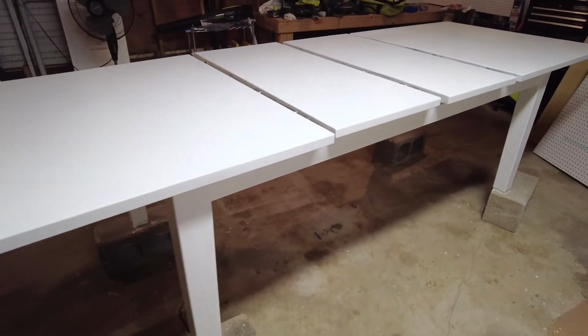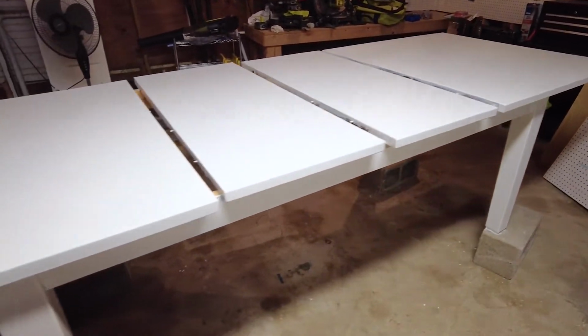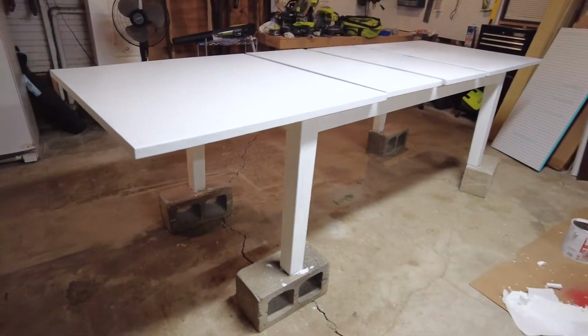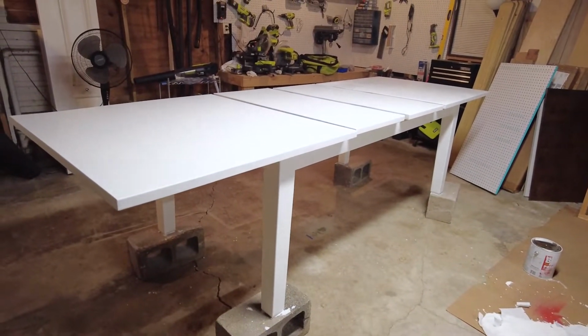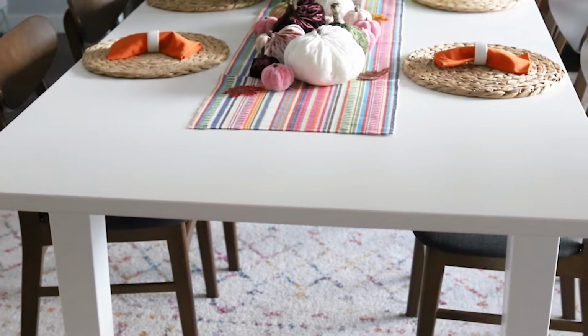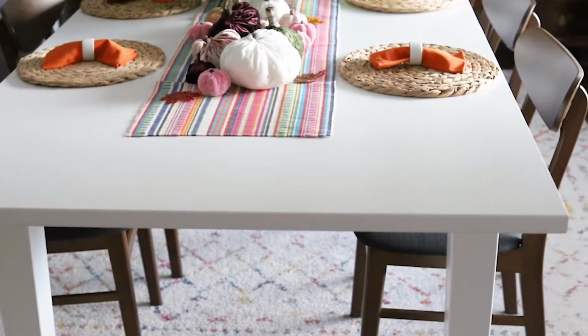After the final coat of paint dries, you can add on a clear coat. This will help protect the surface of your table and keep your paint from chipping. I will link the polyurethane I used for the top coat since it doesn't yellow and it went on crystal clear over my new paint. I used the matte finish, but it also comes in a shiny finish.